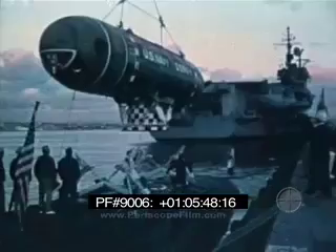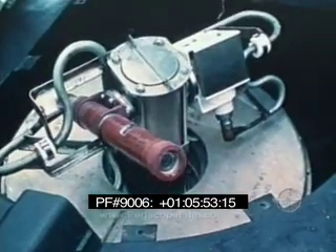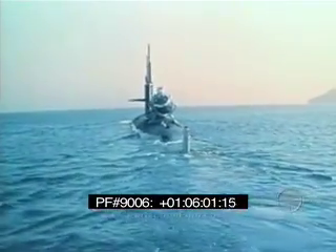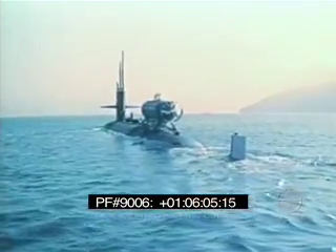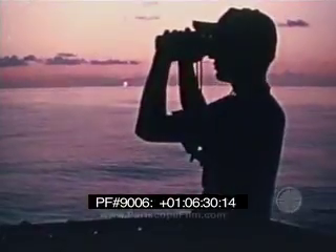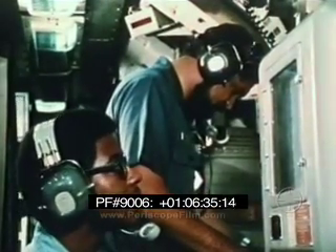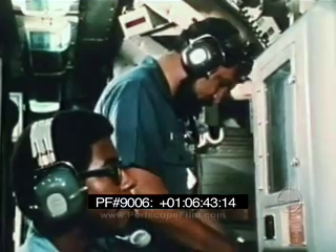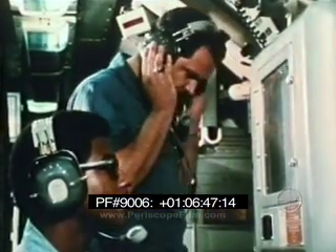Now it all comes together. Part of the mother sub's special equipment are TV cameras, which observe the DSRV when it's piggyback on the sub. Once loaded, the mother sub and DSRV head for the search area. On the surface they proceed at speeds limited mainly by the sea state, or they may move at 15 knots submerged. When the DSRV arrives at the scene, and the search force narrows the location of the distressed submarine to an area six miles in diameter or less, the rescue operation shifts to the localization phase. Sonar men on the mother sub are listening because the crew on the Dissub are also working — they too are active in their own rescue effort. They're helping the localization phase with distress pingers, underwater telephone, submarine sonar, and just simple hull tapping.